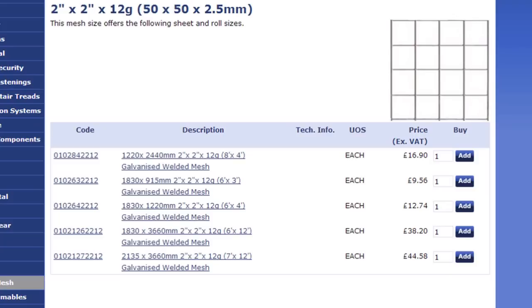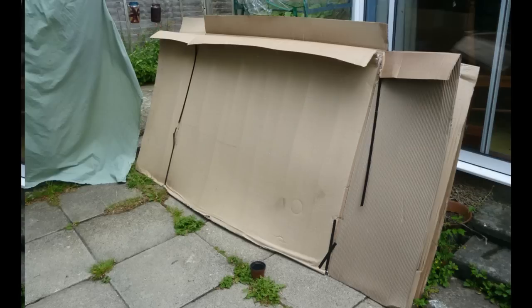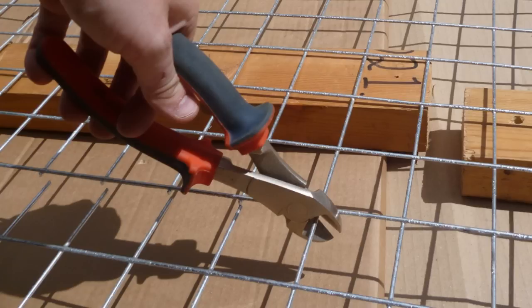I'll hopefully put the net designs for the sheets we used. The mesh when it arrives comes in a massive cardboard box. They brought it around the back of the house. We cut it open and inside were many sheets of wire mesh. Once you've got the mesh and have a design to work to, you'll need to think about cutting it up. For most of our cuts we actually used some side-cut hand pliers. On the 2.5mm material these were really too lightweight for the job - we ended up blunting them quite a lot and had to sharpen them once or twice.